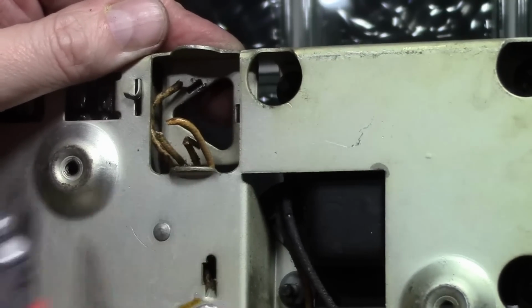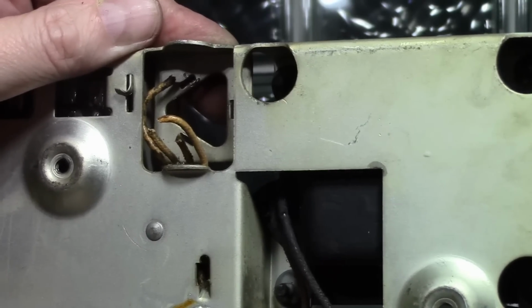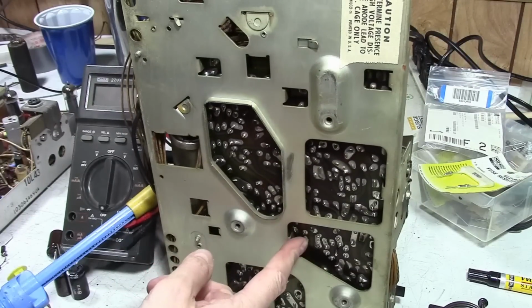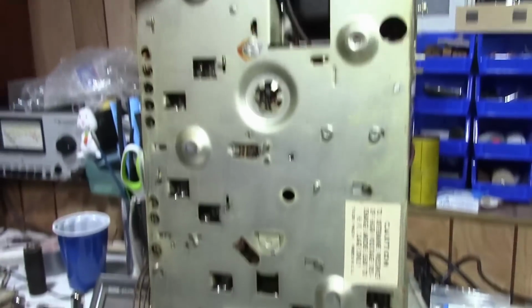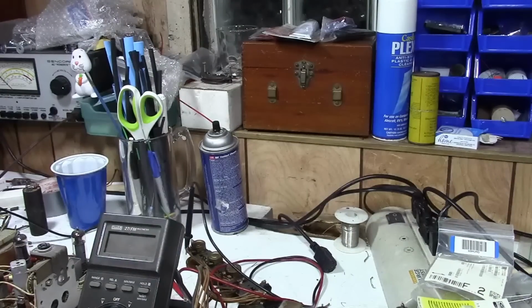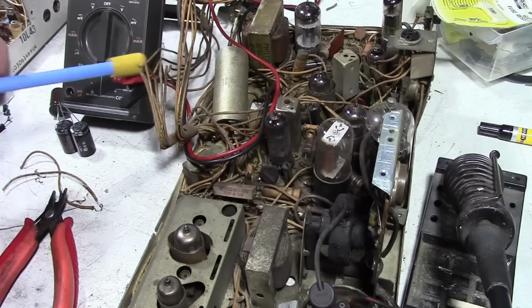And these 3 wires that went here, I know on the other set that I pulled them out and routed them elsewhere. Some of those I think are the caps that ended up on that circuit board down below. So in some regards, or maybe in all cases for all 3 caps, it's actually an improvement. Because the way it's working now is the caps are needed down here, but there was nowhere to mount them because the cap's too big. So they had to run wires from here all the way to here. Well, runs of long wires going to bypass caps is not a good idea because they've got resistance, they've got impedance, they pick up noise.